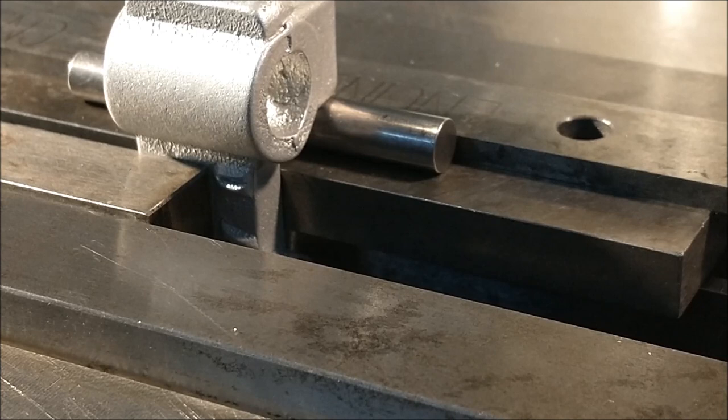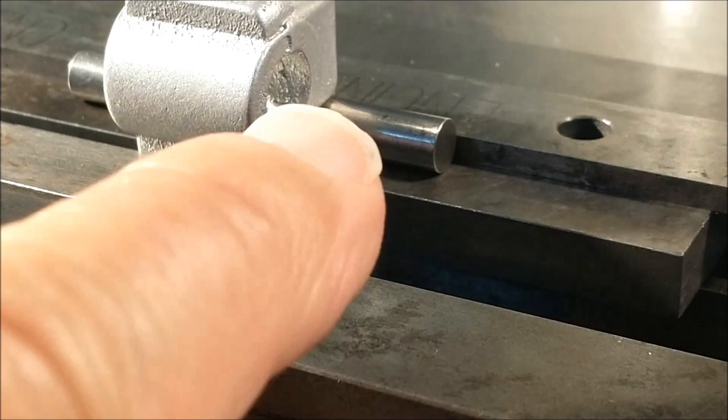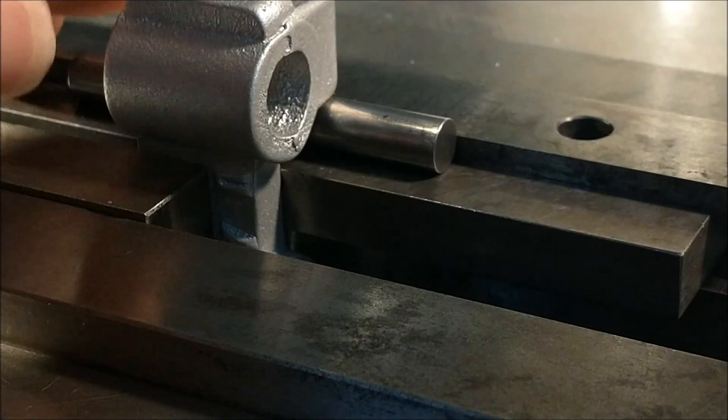With the part securely clamped and registered on what I believe to be the most trustworthy edges, faces, features of this casting, I will pick up the inside edge of this spacer block right here. That will give me the center of that web. And the backside casting is registered horizontally. There's two fingers. There we go. This way, against that pin. So the pin is snug, but not secure.